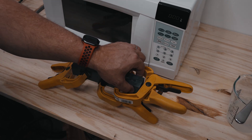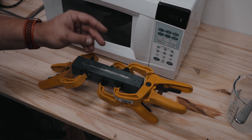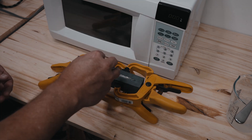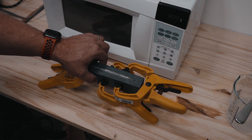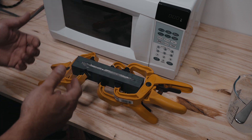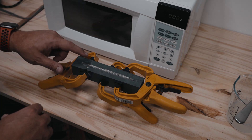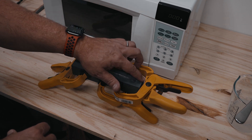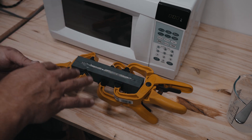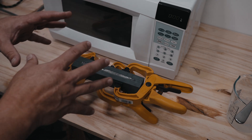Especially on the outside of the mold it's not very warm, which just means it's not dissipating the heat out of the lure. I put roughly 350 degree hot plastic in there and this is still really cool to the touch on the outside. So that just means it's not pulling the heat out of the plastic, and therefore the plastic will take longer to solidify and get down to the right temperature. I'm going to leave it in there a little while longer. I didn't put any lubricant in here — mainly because I don't have any worm oil right now, but also just to get a feel for how easy it is to de-mold without adding anything.